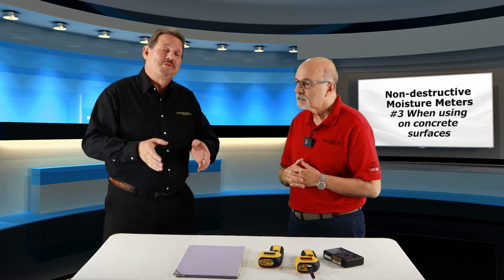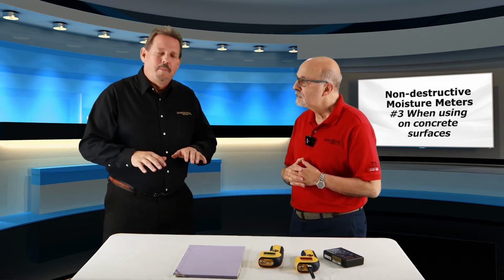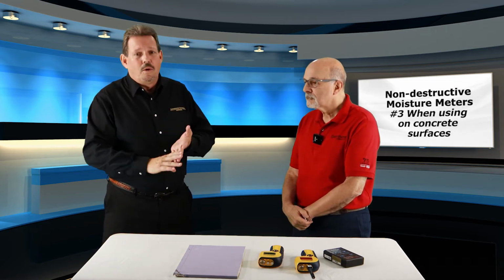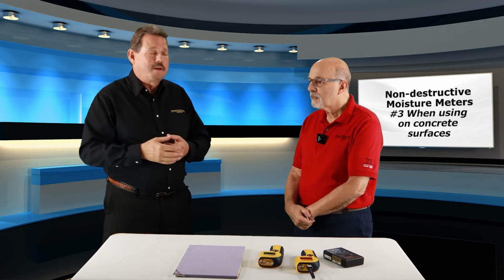One of the other big ones, too, when we use these meters on concrete, one of the things we want to make sure of is that our concrete surface is smooth, but we don't have a lot of floor leveling compounds or old adhesives or anything like that that we're also reading besides the concrete.